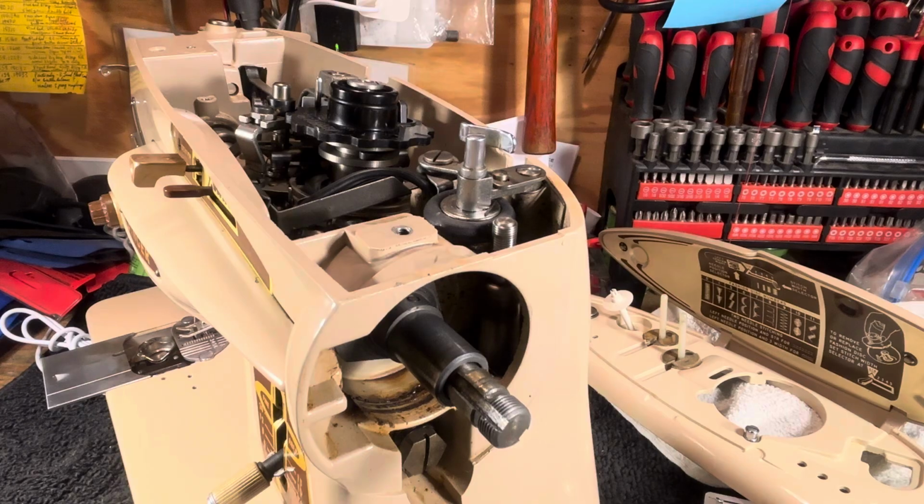There'll be a little bit of a spot on the armature, a little bit of a spot on the motor brush. Every now and then you'll hear a little burp, a little hiccup. But the more you run it, and if you ever get these things out to start a day of sewing after it's been sitting for a month, disengage the hand wheel, run it at high speed till you hear that.